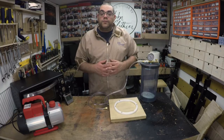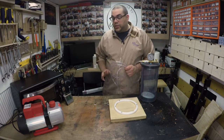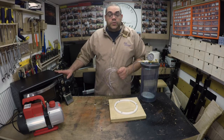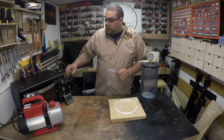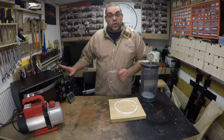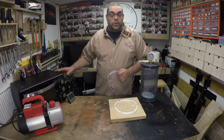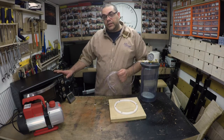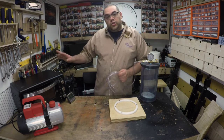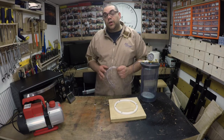I've cleared down my area and got rid of everything I don't need. I'm going to connect this to the vacuum pump. One thing I forgot to mention — you're also going to need a toaster oven that can reach 90 degrees centigrade. Get yourself an oven thermometer to keep an eye on the temperature, because it's really quite critical. Too hot and all the resin leaks out; too cool and it won't cure. I'd recommend a dedicated toaster oven for this — they're very inexpensive, this one was about 20 pounds. You don't want to use your home oven due to fumes and the time it ties up.